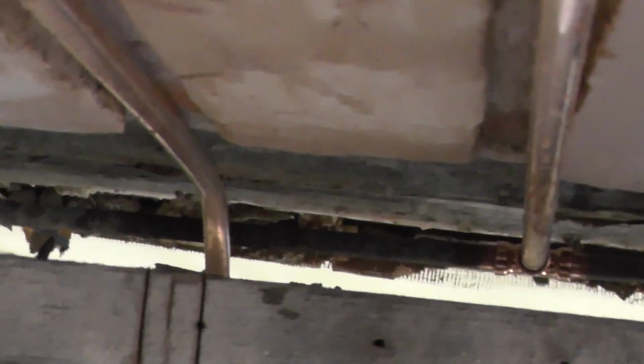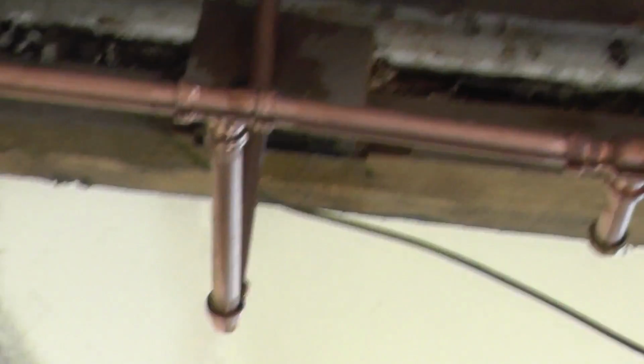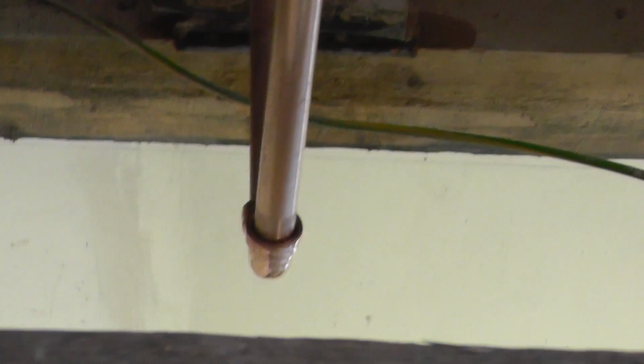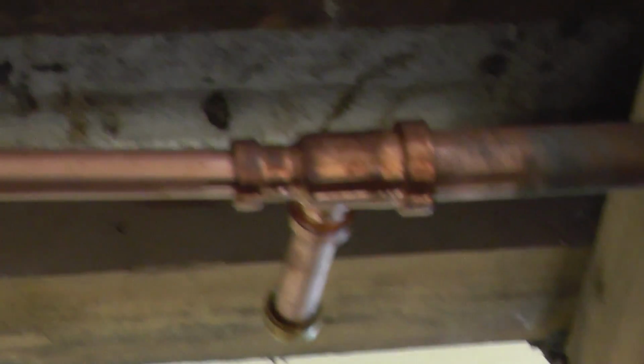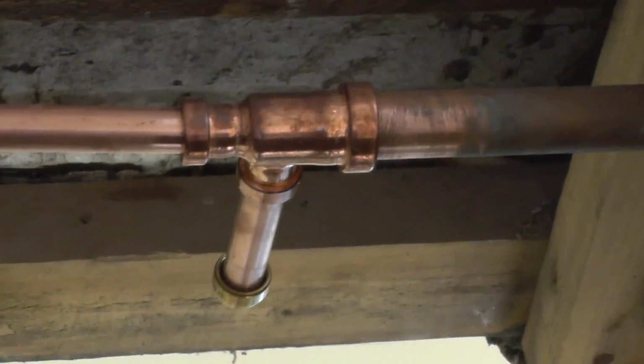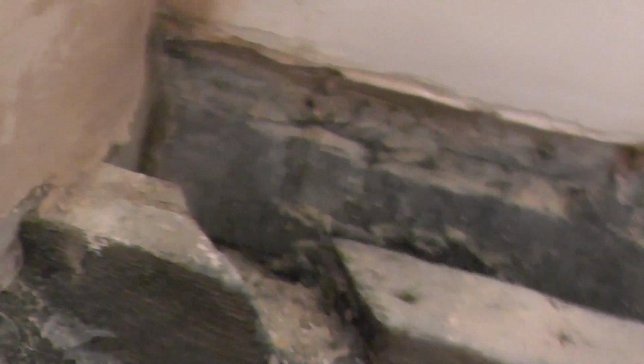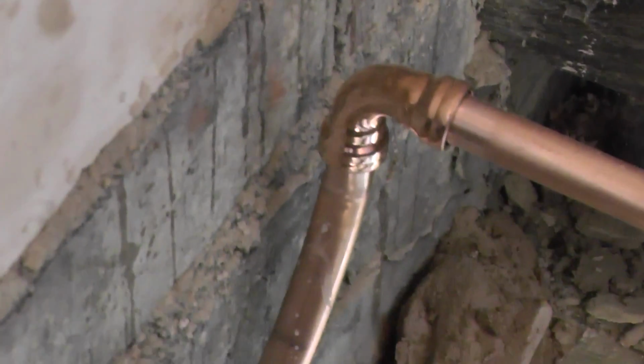Just put a little T-junction down there, bent the pipe for the hot water feed. Put a nifty little connection down here, bent the pipe, stuck another T-connector in there. Pretty nifty that, like so. It's got a 90 degree elbow in there. That's gone from a 22mm pipe to a 15. They didn't have the connector needed, so I had a 22-15-15, so I had to cap the bottom bit off. That's no big deal. Nice little bend in there in this pipe, and once again 90 degree elbow on that. That's quite nice.